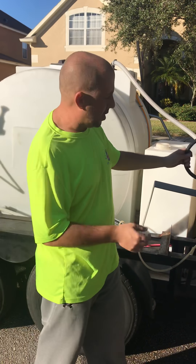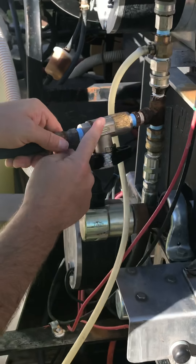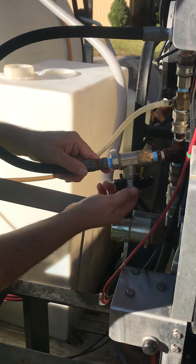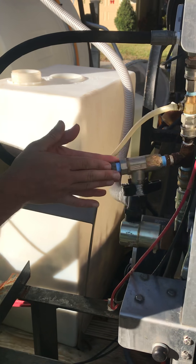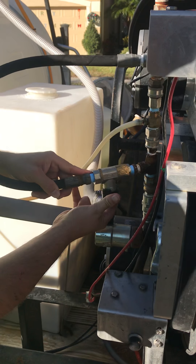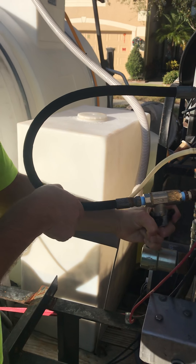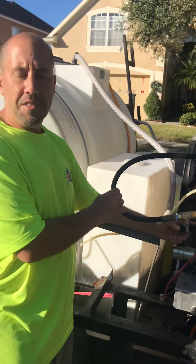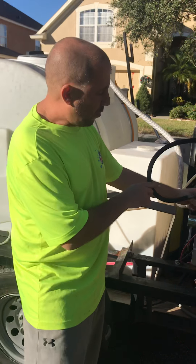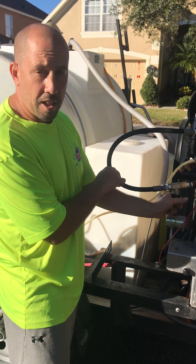In order to draw the chemical, this bypass allows us to have restricted flow or full flow — it's called a ball valve. When we want full flow — for running a surface cleaner or rinsing — we want it on full flow, and you know it's full flow when it's parallel. When we want to draw soaps or chemicals, we restrict the flow by simply turning that valve. If it's at full flow, it will not draw soap. So one of the first things to check if you're washing a house or driveway and you're not drawing chemical is to look at your chemical bypass and make sure you have restricted flow, otherwise you won't draw any chemical.